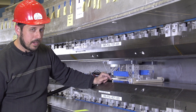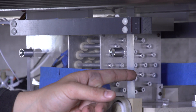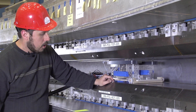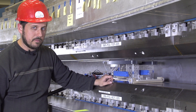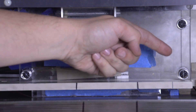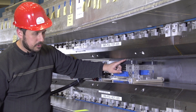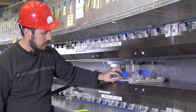To measure the magnetic field, we have 25 nuclear magnetic resonance probes that live exactly where the muons are eventually going to live — right in the center. We also have a couple sets of probes that allow us to understand the geometry of our measurement device. We have reflectors that allow us to measure the position in space of this cart, and we also have sensors at the very top and very bottom that sense how far away the pole piece is from this cart.